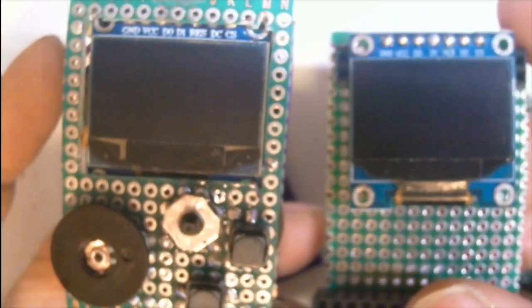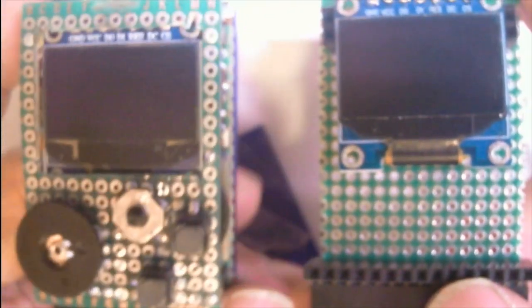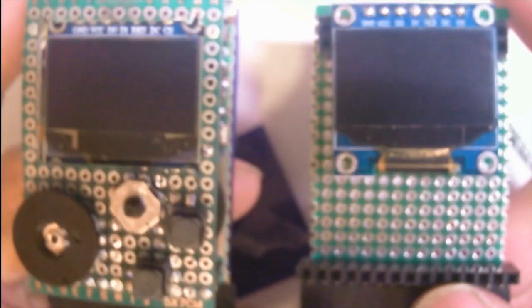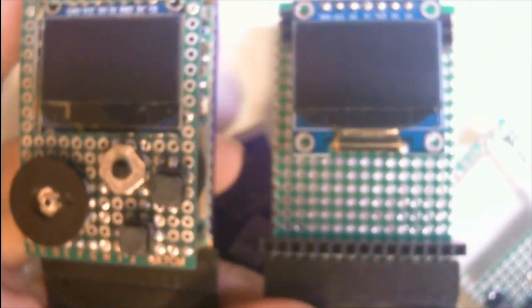So that's why we can mirror the display. So if your mirroring doesn't work, probably the cable may have a problem. It may be either too long, or some of the connections are not soldered properly. You can just check it.